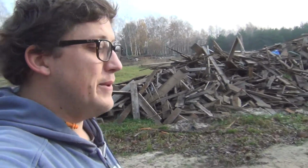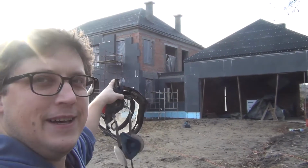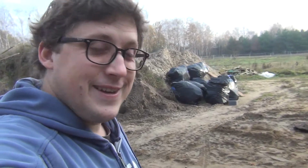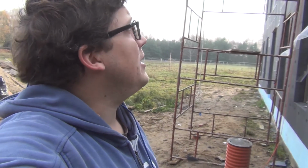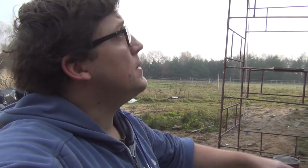The second thing, or maybe the thing that I will start out with, is I'm gonna grab my grinder and cut out that piece of concrete that is sticking out away from the wall. It's been a big problem for the guys. Everywhere where the wall is not plumb, straight, or concrete is flowing out, like over there, they have to spend a lot of time to fit the styrofoam into position so that it matches the curvature of the wall.